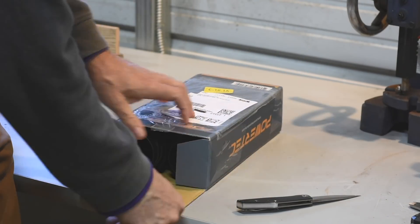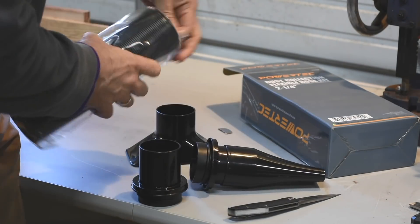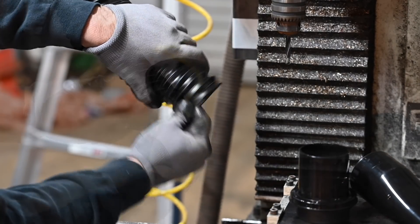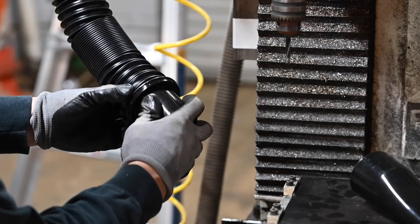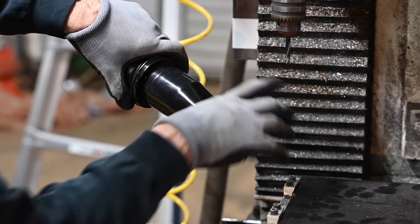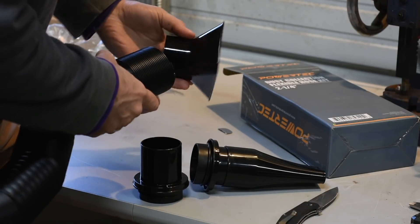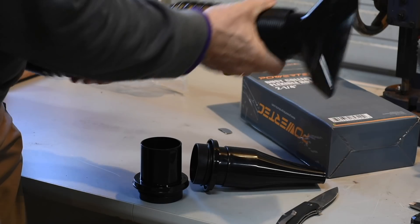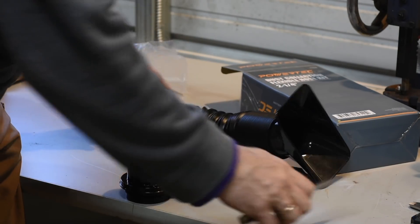Here is the cheapest of the cheap. This whole kit — the Powertech 70208, a hose, two nozzles, and some adapters — cost about 25 bucks. The way it works is that you extend the ends of the hose and screw it into these little two-and-a-half-inch adapters. Those adapters are then compatible with most shop vacs. You stick the dust collection nozzle on one end and the adapter in the other, and then you can pull the hose out to whatever length you need. It articulates and freezes in whatever position you want — freezing being a somewhat impressionistic term.